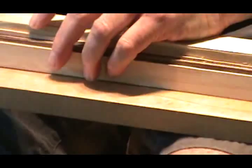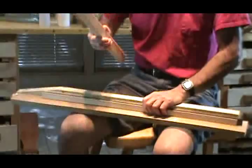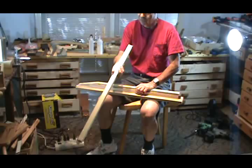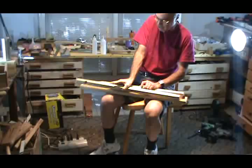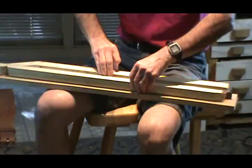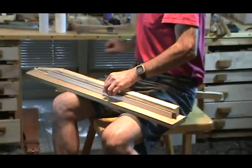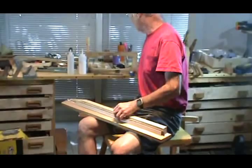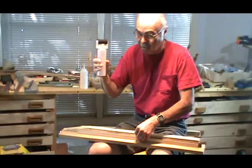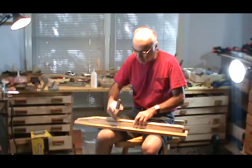Everything is nice and tight. Basically it gets set up like this, and then there's a caul made out of a one by one-and-a-quarter of pine or fir or whatever scrap material you have. One side is faced with packing tape, the bottom side is faced with packing tape as well, and you push it in against the caul and back against the face making sure everything is all lined up. For those of you who are not working too quickly, before you put this into your gluing clamp you might want to use a little bit of packing tape to wrap up the veneers so they'll all hold together before you put them in the jig. I also recommend gluing on a coolish day in the 60s because if you work slowly and try to glue them all in, they might start to dry before you get them into your jig.